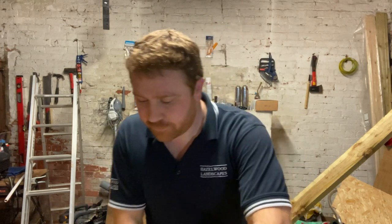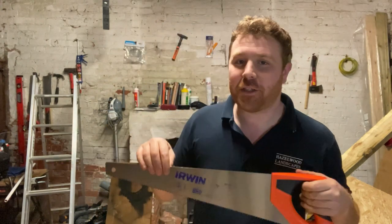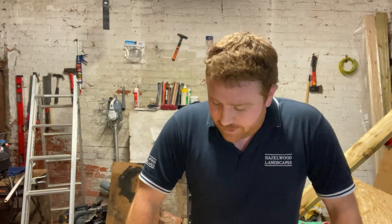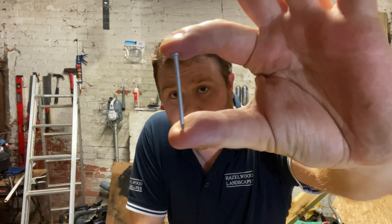This is a specific box designed to attract Robins to your own garden. What you're going to need are as follows: a saw — just a coarse timber saw. Do be careful, these have some sharp teeth when they're new. Try and use a newish one because it'll make the cutting a lot easier. Don't use one you've been cutting roots with in your back garden. You're also going to need a hammer — a nice simple way of putting these boxes together. I'm just going to nail them because it's so easy, and the nails work fine. You'll need some 40 millimetre round wire nails with a flat head, which you can get from your local DIY store.